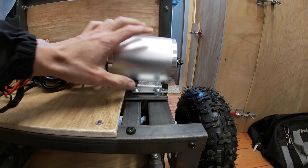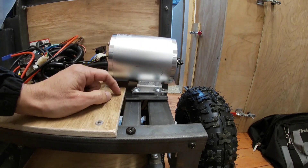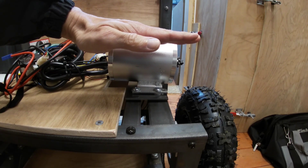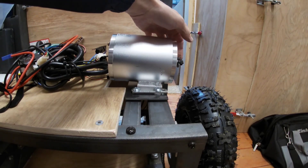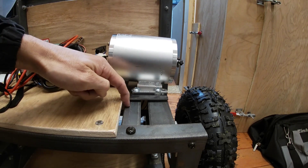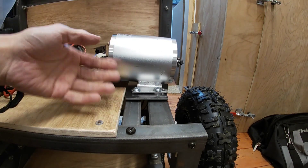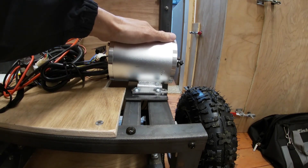Well, we're not doing a test yet. I got it outside and had two goes, and both times it threw the chain off within about five metres. It's not a lateral alignment issue - those two sprockets are still in line - but the motor appears to be tilting downward, meaning the sprocket is closer to the axle, the chain goes slack, and it comes off. Either the mounting angle bracket has bent, or - more likely - the aluminium foot on the motor has bent, so we need to get the motor off, have a look, and bend it back straight with a small modification to make it stronger.